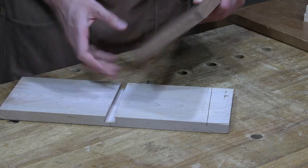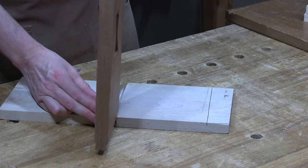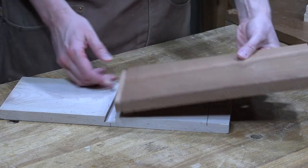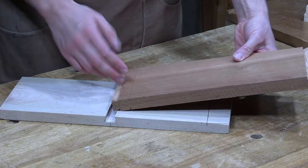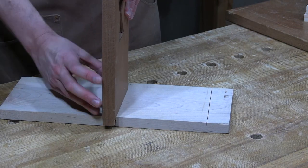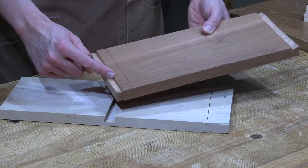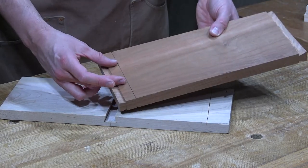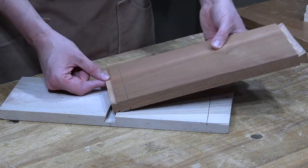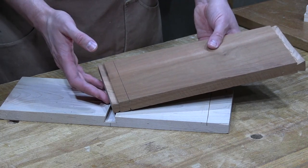Just a quick overview of the joint. Obviously we have a dovetail shaped on the bottom. The dovetail allows these boards to interlock together. The sliding dovetail allows you to run the tail across the board in a cross-grain situation. By fitting these two together, this board is allowed to expand and contract. You don't glue it — or if you do, you glue just the first inch or two and allow the rest free to expand and contract. Because we have a dovetail shape, it locks the pieces together, and these can be quite tight and really don't need any glue at all.